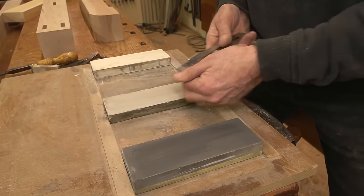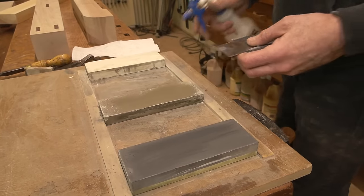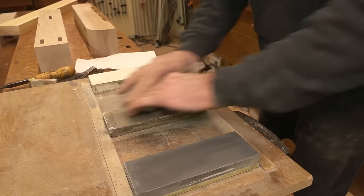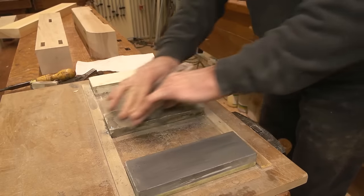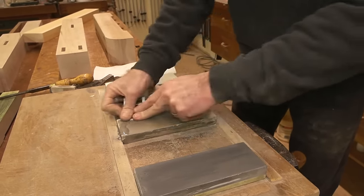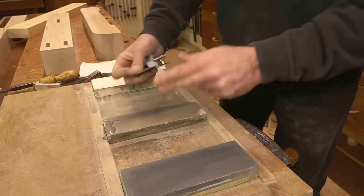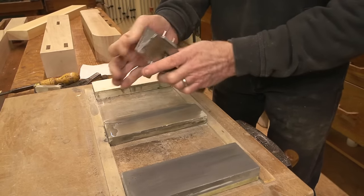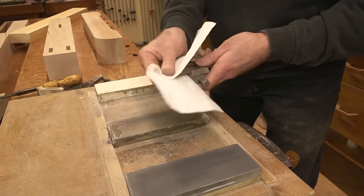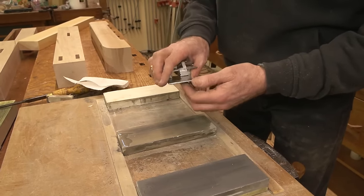Because this is a narrow wheel, I'm actually pushing into each corner, which ideally creates a very soft radius or camber on the leading edge. That helps create these almost very subtle scallop shavings so you don't get that hard dig line on each end rather than being dead straight across. I'm going to hit this until I see an even matte sheen on the 1,000-grit stone, then go to the 4,000. I also have to polish the back — the sharp edge is the combination of those two surfaces meeting, so you've got to have the same hone and polish on both surfaces.